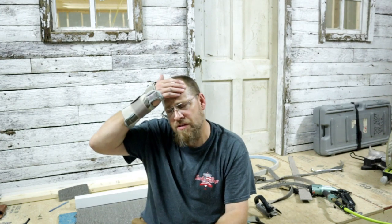Okay, so I hope this video helped. Maybe some of the new guys in the trade or the handyman that just wants to go out and do a little bit of his own work on the side or something like that. Anyway, maybe this will help you guys persuade the customers to allow you to remove the old tack strip and put more down, not necessarily just to rack up money, but for the customer's sake, for their benefit, for the longevity of the product that you're installing. It is very important that the tack strip is placed in the proper way so you can get a proper stretch and cause their carpet to last for many years to come, okay?